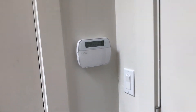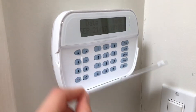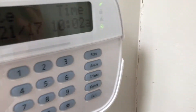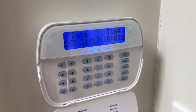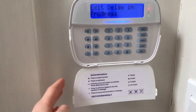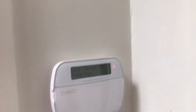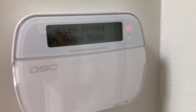This time I'm going to demonstrate the upstairs hallway motion detector and arm and disarm from our front door keypad. Press and hold away — this one has the words on it. Since it's wireless it has to communicate with the panel — there it goes, exit delay in progress. We have to wait 60 seconds until that ready light goes away and it is fully armed into away mode. It's beeping faster and almost done with the exit delay — all right, it's armed into away mode.